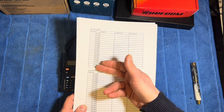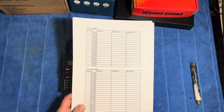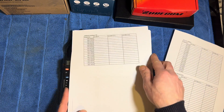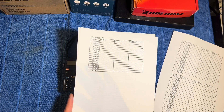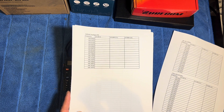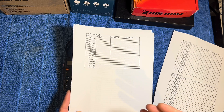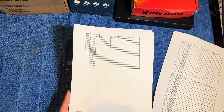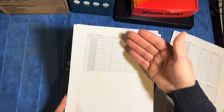We're going to test on the two meter frequencies, which is 144 to 146 megahertz here in the UK, on the 70 centimeter frequencies which is 430 to 440 megahertz here in the UK, and just for fun I'm also going to measure on the PMR analog FM channels. Theoretically we don't use Baofeng radios to transmit on PMR channels because PMR is the license-free walkie-talkie version here in the UK. Those radios should be less than half a watt, and these radios are definitely not below half a watt.